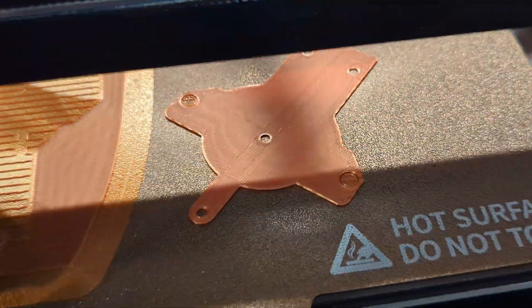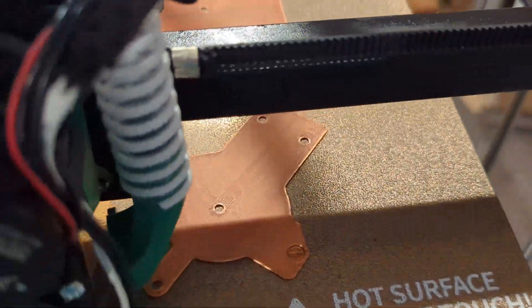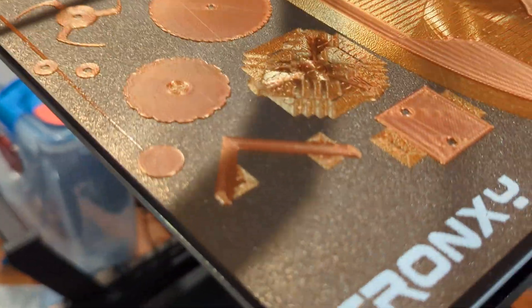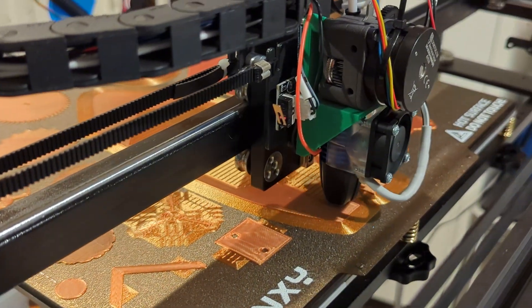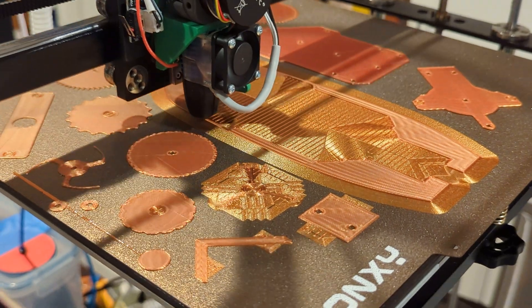Sorry for the zooming. I might not have my flow tuned perfectly — this is still only like the third print on this — but the leveling was perfect. The part I was actually testing with the contact nozzle bed sensor was just perfect.